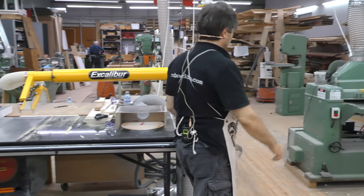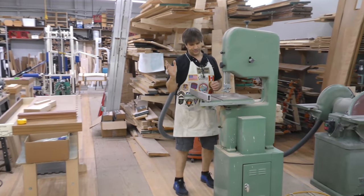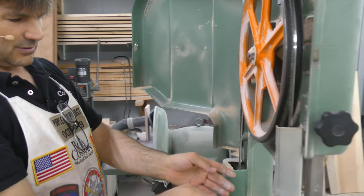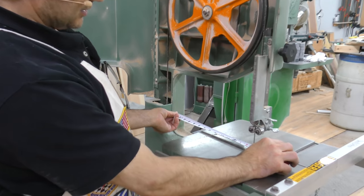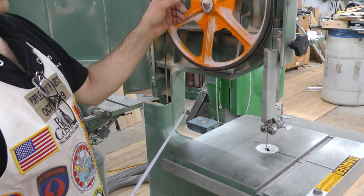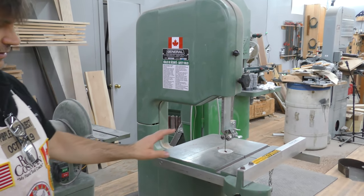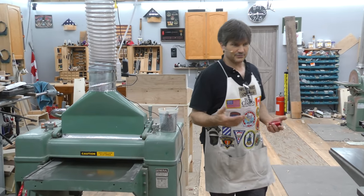The fourth tool is a bandsaw. Some people would say this could actually replace the table saw — I don't think so, but it certainly is extremely versatile. This is a 15 inch and I don't think I'd get anything too much smaller than that. The reason is the diameter of the wheel: the smaller the diameter, the shorter the throat. This allows me almost 15 inches between the inside of the column and the blade. If you get a small eight inch wheel you've only got seven and a half inches in there, and your blade has to flex a whole lot more. Bandsaw would be number four, and if you wanted to go further I would put a thickness planer as number five, but if you're working with a budget you have to do them one at a time.